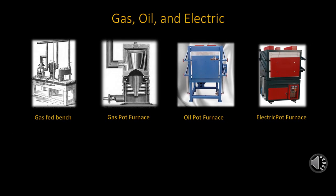The coke-fired furnaces had an inherent problem, such as the probability of sample or bullion contamination. Because these were coke fired, ash was the problem. Other problems were in the temperature control of the furnace — they were not that accurate, to say the least. The ash pits had to be cleaned constantly, and coke had to be produced for these furnaces, which was labor intensive. As time went on, oil, usually in the form of kerosene, became more available. Furnaces were either converted to burn these fuels, and new furnace designs incorporated efficient burner components.